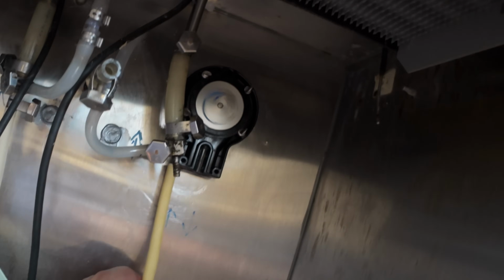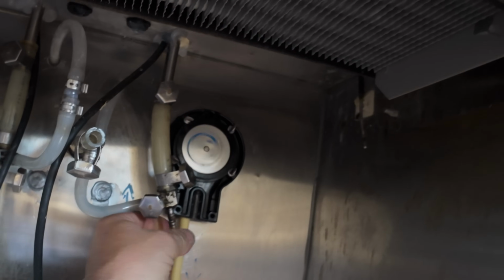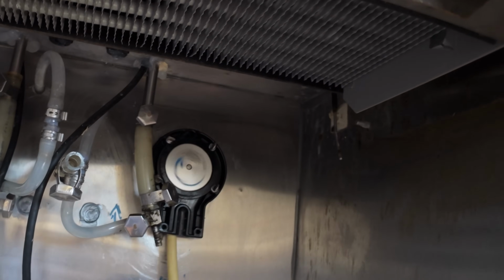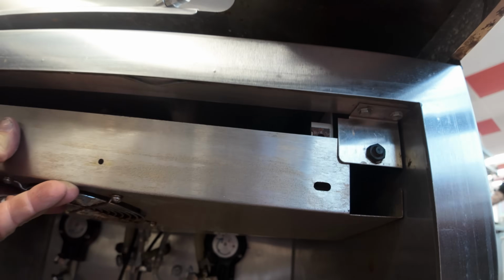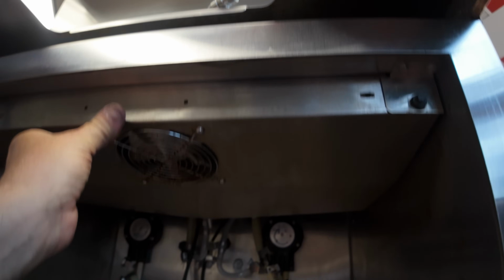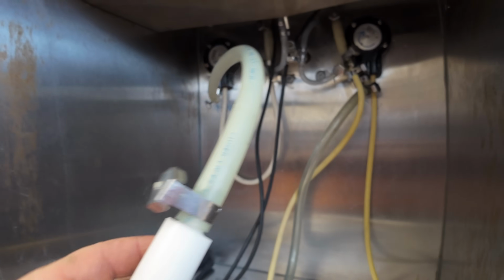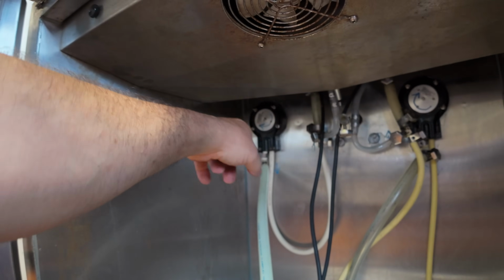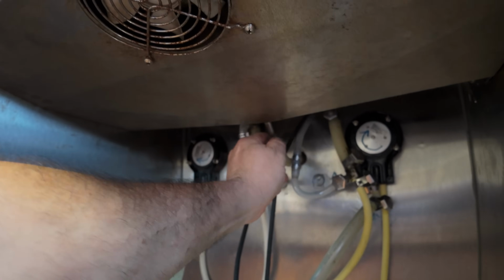Okay, the way I do this, when it's simple like this, I just stick it through and let her feed. Otherwise, I'll take that apart, wrap it around it, turn it on, then shove the cover over it. Hooks on that corner there, and hooks on that corner there, comes up, and goes in a piece like that. And you get two thumb screws. There's a check valve in here, a little rubber deal with the spring, goes up to there, sucks it in through that little pump set, roller system there. Comes up to there, air pump comes into here, pumps into that. Here's the drain.